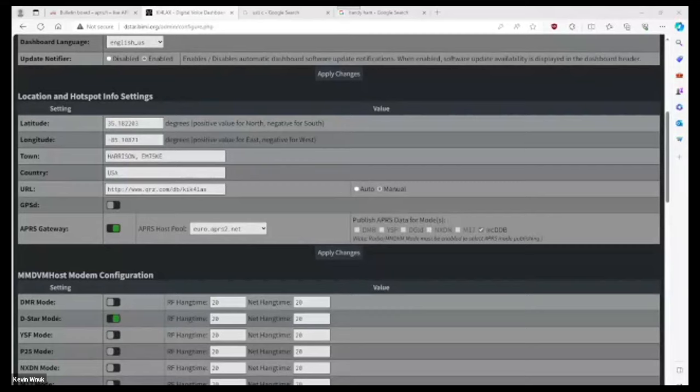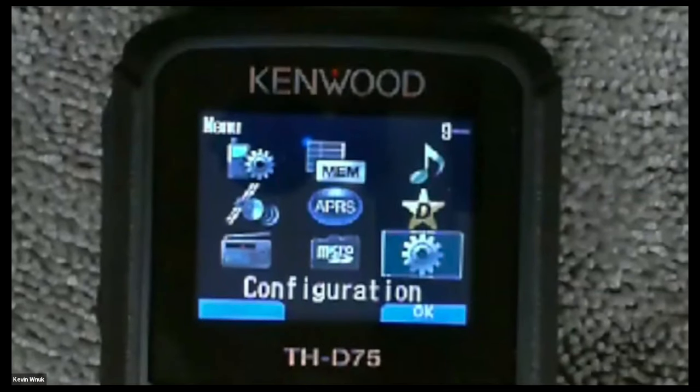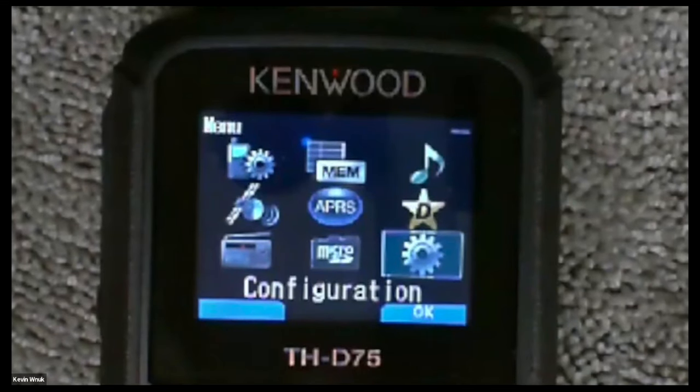Yes. But from what I understand, this needs a fast Bluetooth solution, and low energy Bluetooth just doesn't cut it. At least that's the way it was explained to me. I could be totally wrong. So yeah, basically BLE cuts out a lot of the profiles and tries to save energy. And right, SPP is not one of the ones it supports, and you need the serial profile.